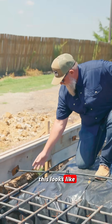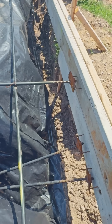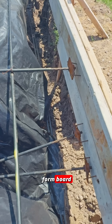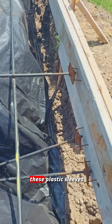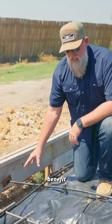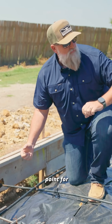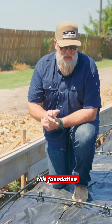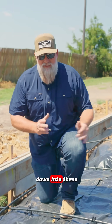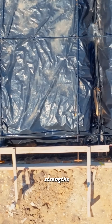And this is what this looks like. You've got basically a flange-like piece that is nailed to the inside of our form board, and you can see there is a cable that runs through these plastic sleeves. The benefit of that is this now becomes a pull point for compression strength on the top side of all this foundation. They also run down into these grade beams, so you're pulling those grade beam strengths together.